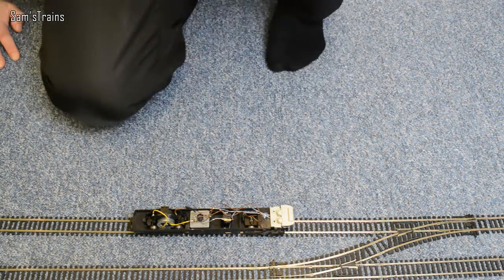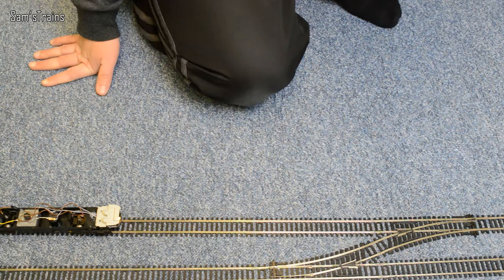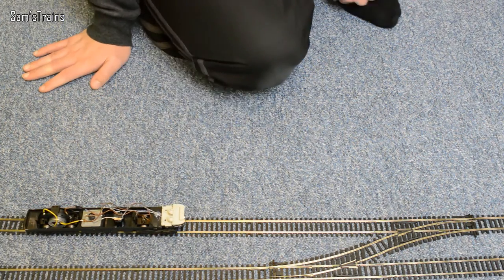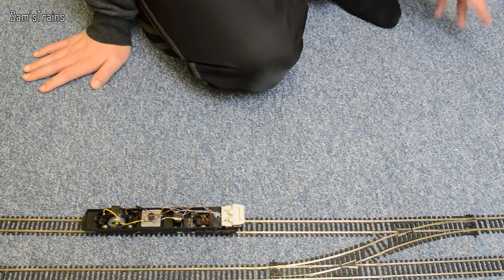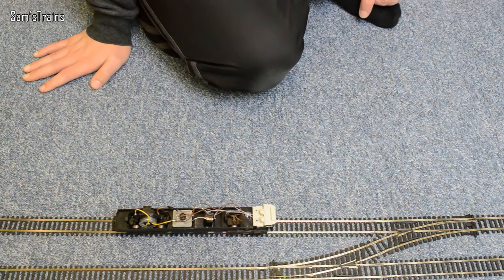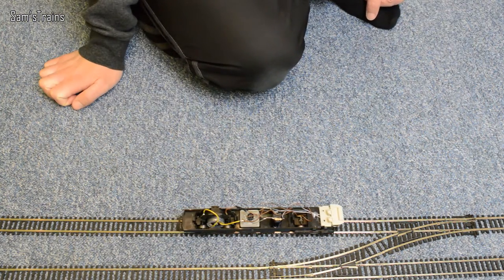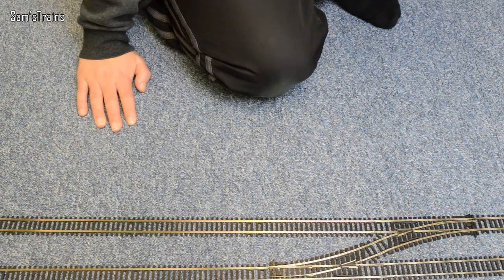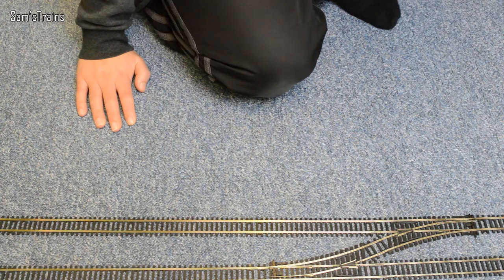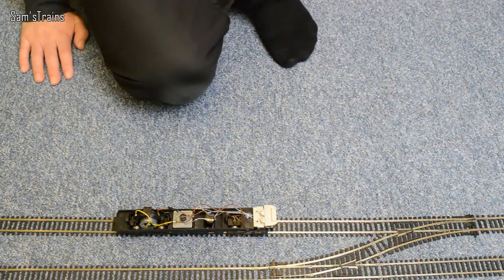As you can see, it basically fits in very nicely. I did have to glue the brass cog onto the shaft because the shaft was a bit too small, but otherwise it's just glued in there. And it does actually work amazingly well — seriously, seriously well, against all odds. I've tested it for hours on end and it really doesn't overheat. I'll show you that running. Being six volts, it does come on at quite low power — that's a good crawl. But it does go at some crazy speeds as well, and you can leave it at those speeds and it doesn't derail itself, and the motor doesn't get hot.